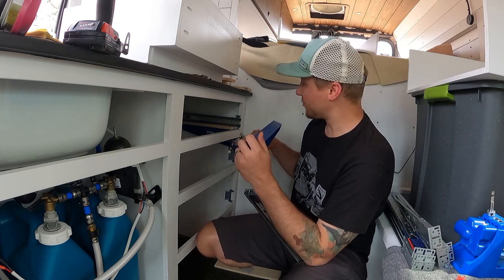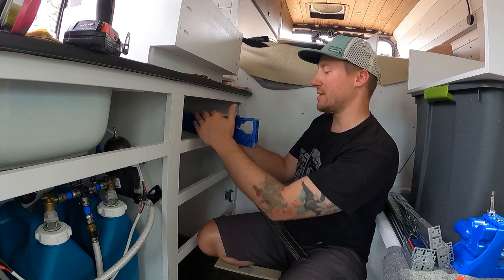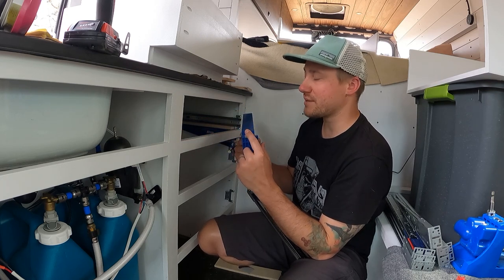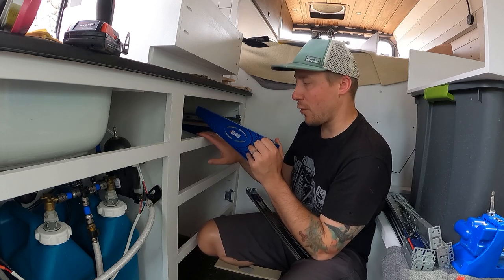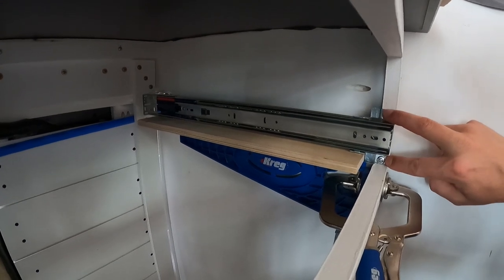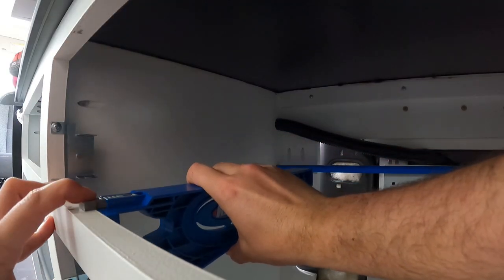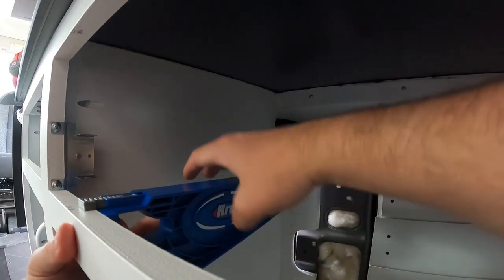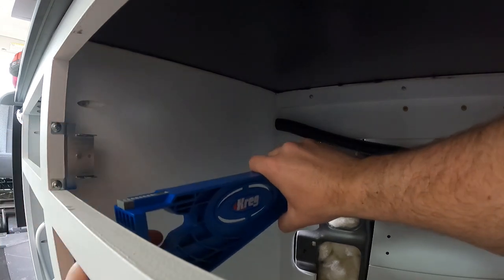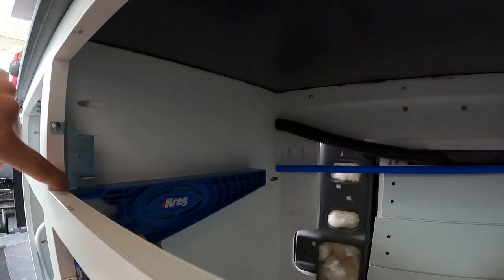One problem I'm running into, because I'm using these face anchors — these usually sit on the face frame and your drawer slide sits on top of this — is that because of the way this connector sits, it sits up higher than this little piece does. So I'm having to find a way of going about it without utilizing this. What I've come up with is putting the Kreg drawer slide jig underneath where the bracket is and then adding a half inch piece of ply as a spacer. Normally this connects on top of your face frame and clamps on from behind, and your drawer slide sits on top, but that is for when you connect it directly to the face frame. So for my application I'm not going to use that little tab — I'm going to butt it up on the face frame and up to the little metal spot on this bracket below.